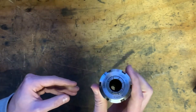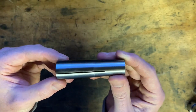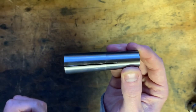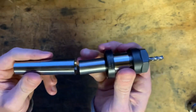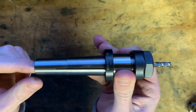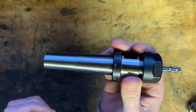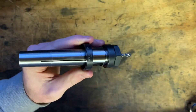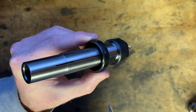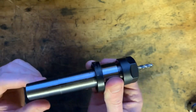What I've gone and done is purchase this Tormac MT3 collet. This goes directly into the spindle on the mill and holds the TTS tool holder nice and tight. You place a drawbar on here and as it's snugged up into the spindle it clamps on the tool. I like this system because it also adds extra rigidity when this piece here snugs up against the nose of the spindle, and it allows you to set all your tool heights offline as the measurements are repeatable.